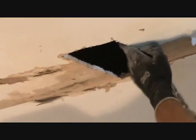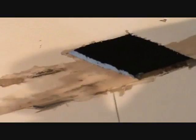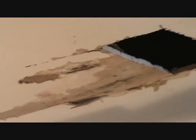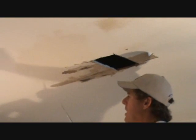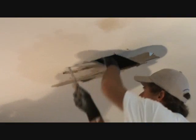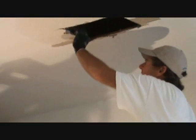I'm going to cut this hole a little bit bigger. I'm right up next to the next ceiling joist, so I'm going to go that way — there's a two by six running across there, and 16 inches over there's another one. I don't want to just say I'm going to saw all the way out and whack the whole thing down in one piece. I'm going to be as careful as I can, keeping in mind I don't want dust going everywhere, so I'll cut it out in small pieces. One little saw like this can do the job.